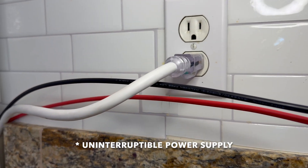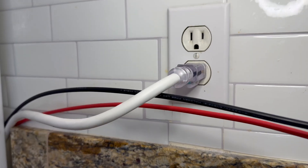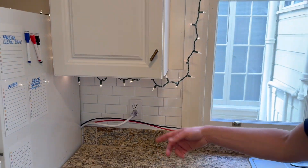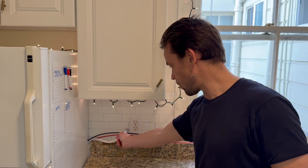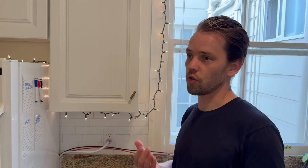It's a solar system size that would feel about right in an RV, and it acts kind of like a big UPS. It's off-grid, not grid-tied, but it can pass through energy from the grid when the battery is empty. Right now the batteries are full and the whole apartment is running off the system — the lights and the fridge. Critically, it never pushes back into the wall. It only draws from the grid as a backup plan when you bottom out your batteries, so your fridge doesn't go off in the middle of the night or you can still cook without re-plugging everything.